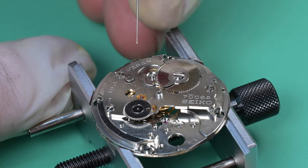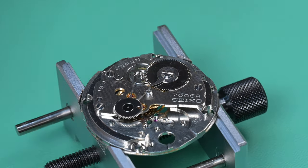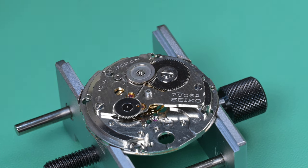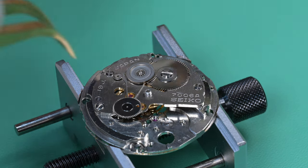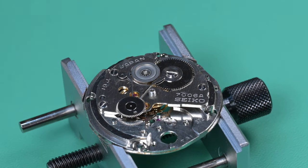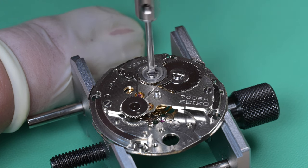Thankfully it worked, but if it didn't I would have put a jewel kit in. Right now I'm lubricating the back part — you can either lubricate the back side of that left paw lever or under that post where it rides. I'm lubricating the stud where the second reduction wheel is going to sit, and then we can mount that wheel on there. Once I get it on there I'll use my little plastic hold-down tool to hold that wheel in place, then move the paw levers out and make sure they're engaged on each side of it. We're going to get this reverse-threaded screw on here and move on to the pallet fork and balance assemblies.